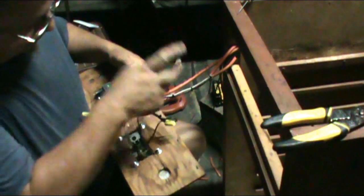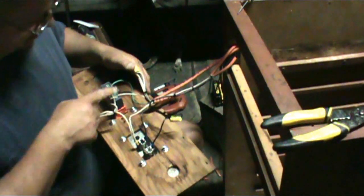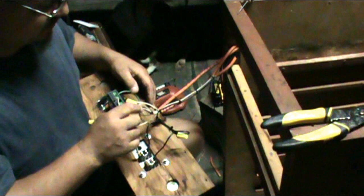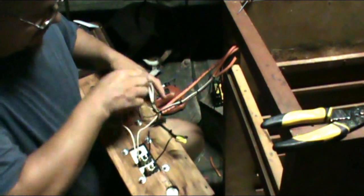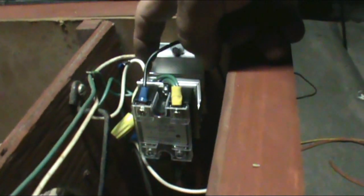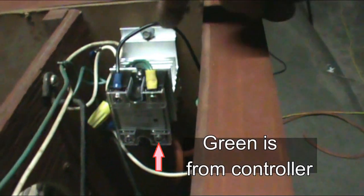When this light switch is on, the fan should come on. Power coming over here to the relay side of the controller. Now the commons are all tied together here, which means the common comes in here. The other switch will turn on a light. Believe it or not, folks, it works. All of the commons are together except for the common for the relay — the common for the relay is separate. This is the main power cord coming in to the solid state relay, and this goes out to the heaters.